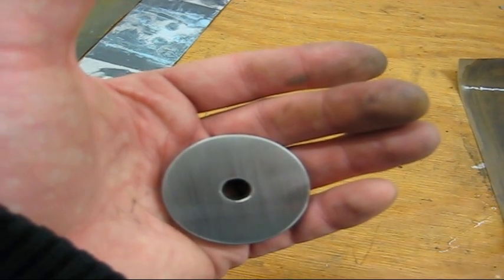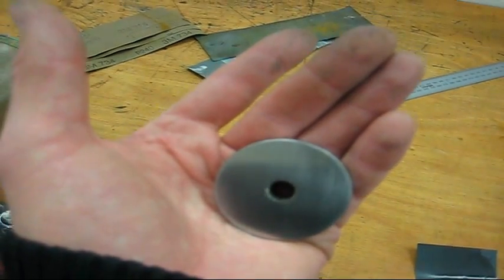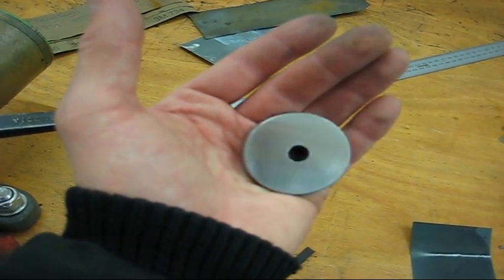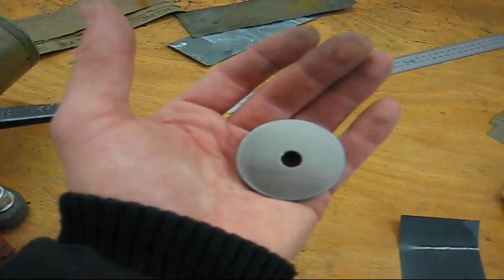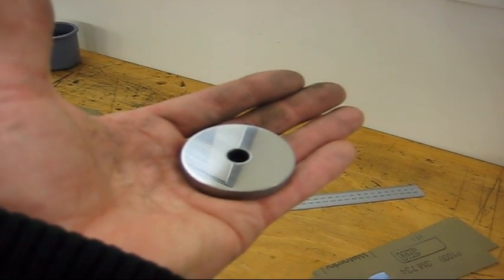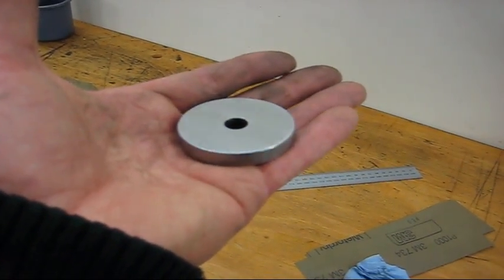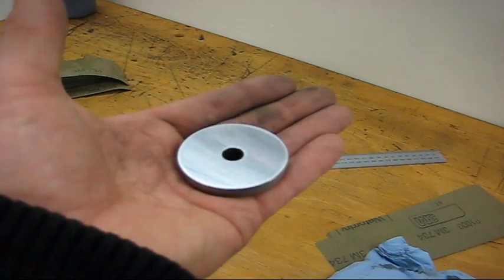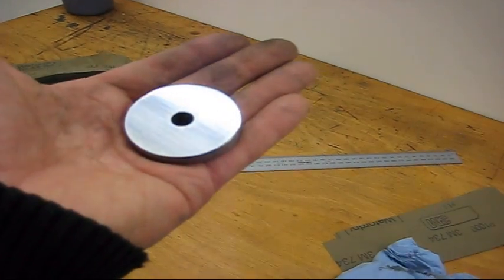So now you're only missing 1000 and 2000 grit. I guess it's getting really difficult to see the sanding marks now, but I'm done with the 1000 paper. So we'll see how it turns out with the finishing step. This is what it looks like after the 2000 grit. As you can see the sanding marks there, maybe. I'll just polish it with some compound and I'll be done.